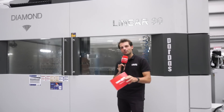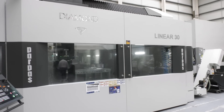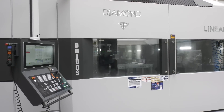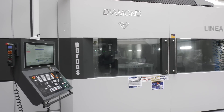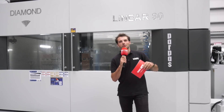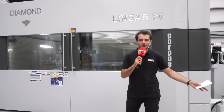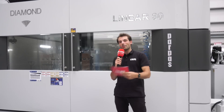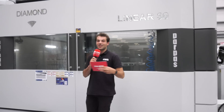These are generally targeted at aerospace and automotives, so we're talking aluminium prismatic parts and also mould and die tools for punching automotive doors. The problem with those is there are very different kinds of materials. With aluminium you need a high RPM, not necessarily high torque, whereas with a mould and die you probably need high torque to cut through that steel.